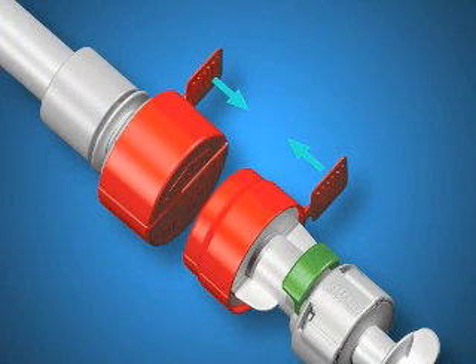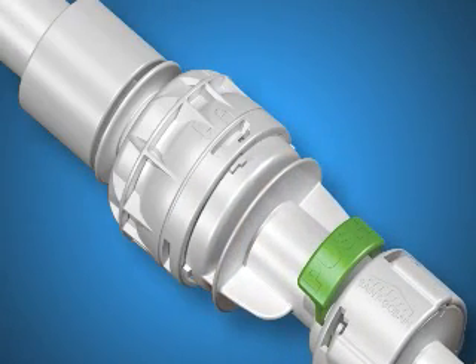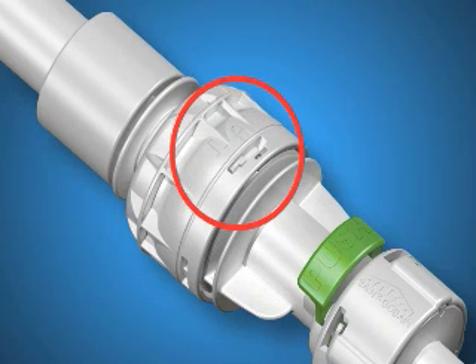Pull up the tear tabs, then remove the protective caps. Insert the inner housing into the outer housing, making note of the lock size versus the slot size. You can now rotate the inner housing inside the outer housing to line up the locks. Insert the inner housing locks into the locking track window, then rotate the inner housing clockwise until it locks.